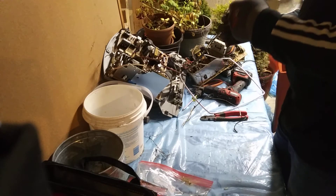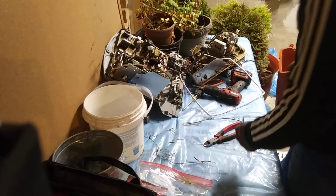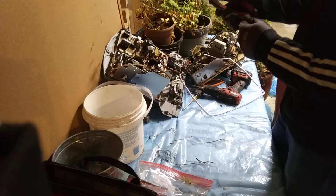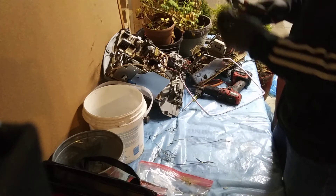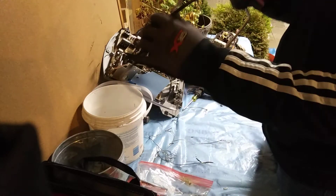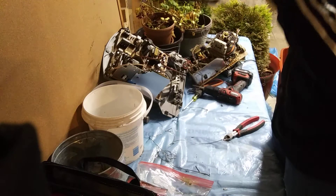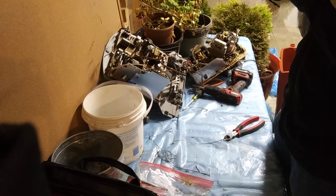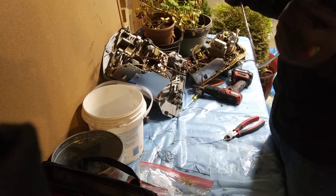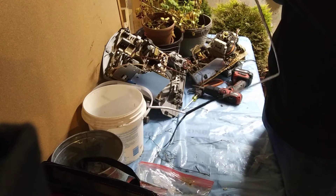More tin copper. I do have another video I'm going to probably record right after this one - it's a bunch of really old vintage laptops, which I think could be really really cool. Now with degaussing cables, some of these are aluminum, some are copper. For the most part they're copper, and this one really feels like it's copper - and it definitely is copper. If they're really really light and don't feel as dense as they should for a large piece of copper wire, it's probably aluminum.